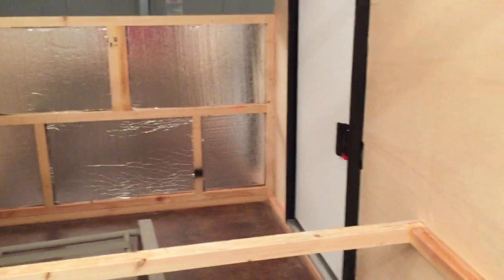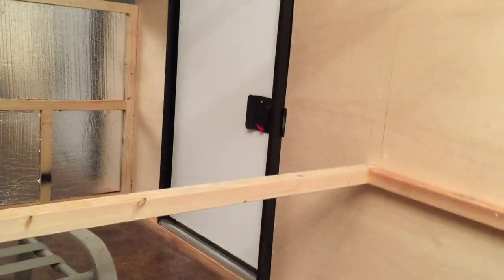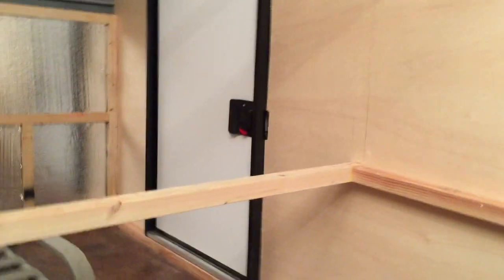That door really feels great — with the locks, keys, and a deadbolt, it's just going to be really nice. It's got screw holes and screws directly into the sidewall. You'll want to put weather stripping between the trailer wall and the door. Where I goofed up a little and have some gapping, I'll inject that with something waterproof or insulating, and I'm going to put a decorative trim around it to help hide that.